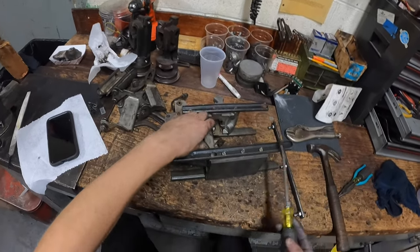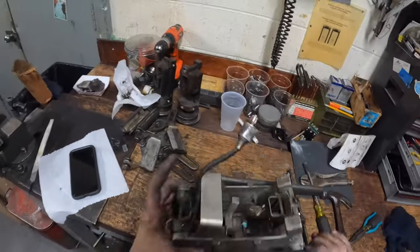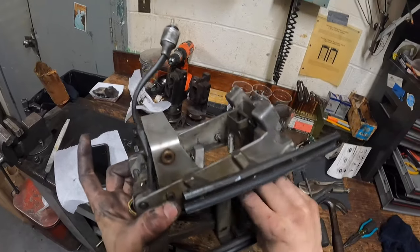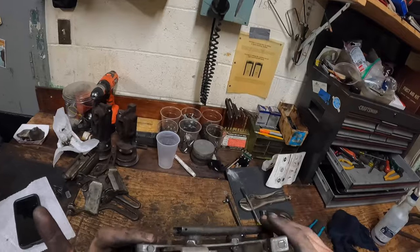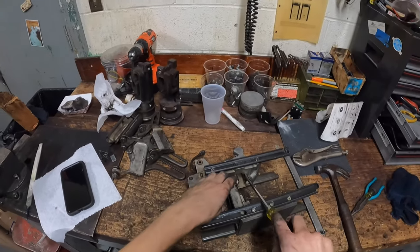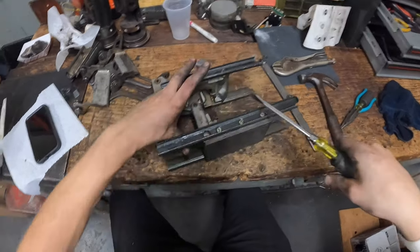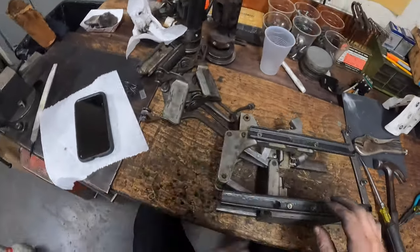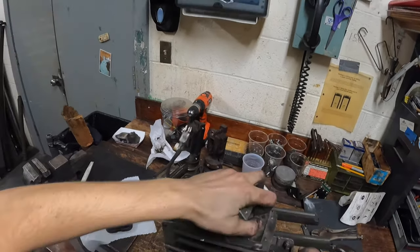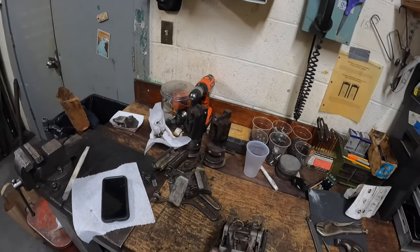What flips this little star gear right here is this little tab. This is the star latch itself, this is the assembly. If you have this problem, you can actually do this while the respot cell is still on the machine - I've done it many times. All you have to do is bend this little tab out just a little bit - you don't have to go crazy, just to the point where it catches and doesn't stick.